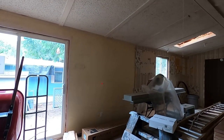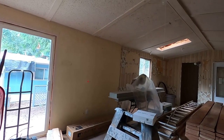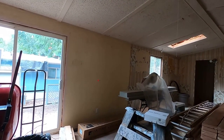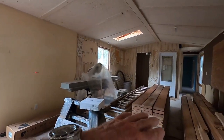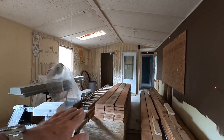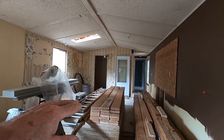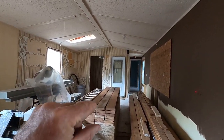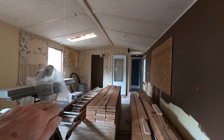There are different ways to find that high point, but for me I like to do it from the inside of the home. You can lay levels on the floor, but by the time you keep moving your level you can get a degree of error. You also start to encounter different thicknesses of flooring, which can affect where your level is sitting.